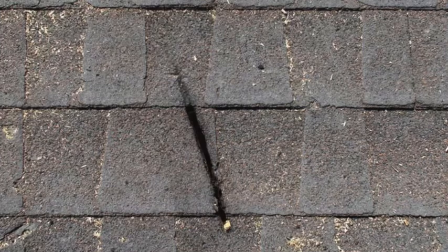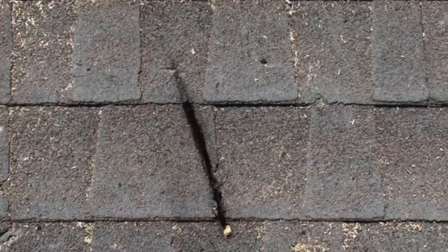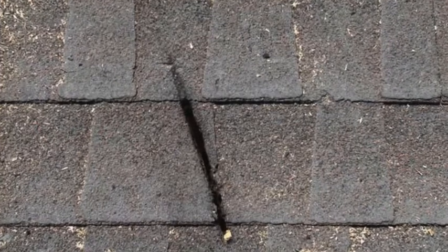Here are demonstrations of the various diagnostic cuts for vertical ventilation. The first is a kerf cut. This is just a single cut the width of the bar, made every 10 feet along the roof to find smoke or fire below.